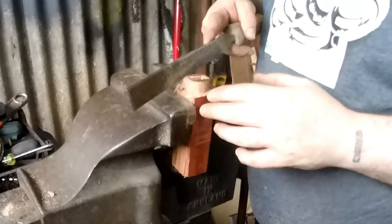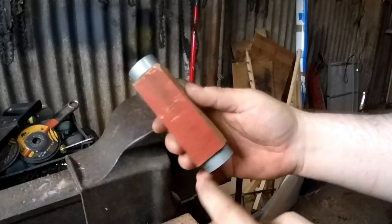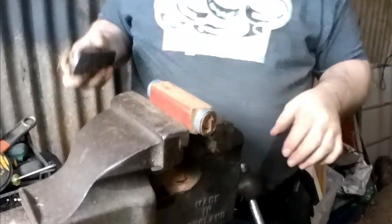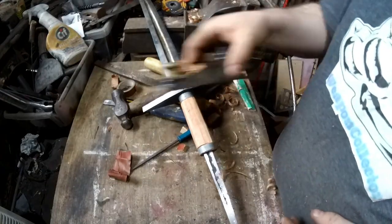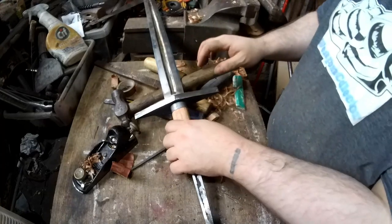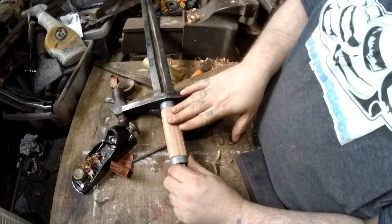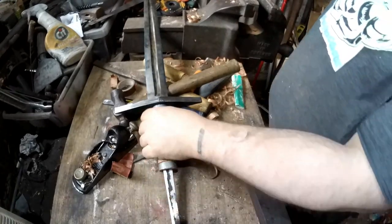Because this is two parts, the collar will prevent it from splitting. It'll be glued anyway. So I've got the collar on the top and the bottom, I can now shape the handle — until I start getting close to the metal collars, and then I'll shape it by hand. The handle fits and tapers back so it gets fatter as it comes back, so your hands shouldn't want to go up. We'll have a big pommel there. If the handle fits — still needs tidying up, I need to bring these rings so they fit properly — but that'll be perfect. I really want this to be a one-handed sword.